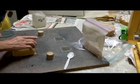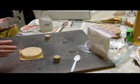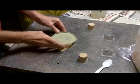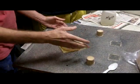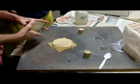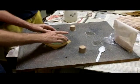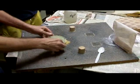And so we will wind up with a tool that's like this on this surface here, and it will be the same operation that we were using before, which is just moving back and forth and turning back and forth with a polishing compound on it. And it will probably take maybe an hour or so to polish it, maybe small. And the interesting thing is it's exactly the same stroke as a grinding stroke. Back and forth, turning, turning.